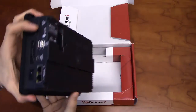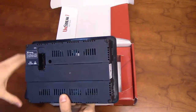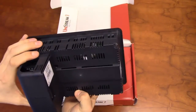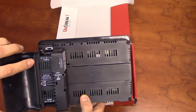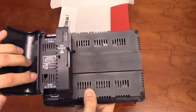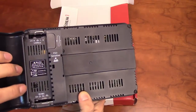The back of the unit will have a plastic DIN rail for mounting the CPU as well as IO and communication modules. The CPU will plug into the back of the unit and is secured with the DIN rail clips. The CPU will have a CAN bus communication port on the top, and an RS-485 communication port on the bottom. The CPU also details the DIP switch settings for RS-485 communication.